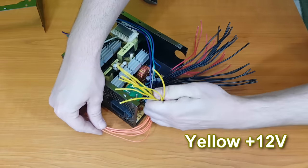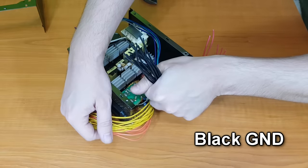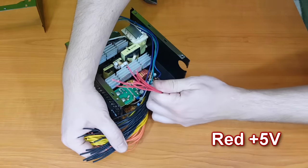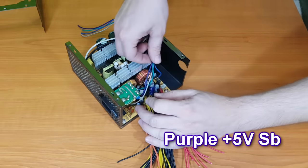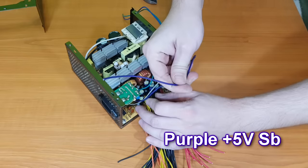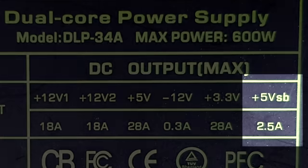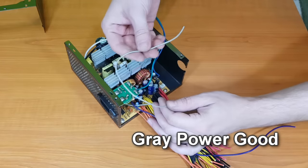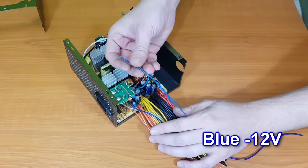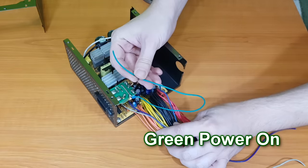My panel ammeter goes up to maximum 10 amps, but I don't think I need more than that for my electronic projects. Black is ground, obviously. Red is positive 5 volts. Purple is positive 5 volts standby — this wire will always provide 5 volts if the power supply is connected to AC power, even when it's turned off. That's why on your computers you can charge your phone from the USB port even if the PC is turned off. Gray is the power good connection used by the motherboard — we're not going to use it. Blue is negative 12 volts; for me it's not useful because it has only 300 milliamps. And finally, the green wire to turn on the power supply.